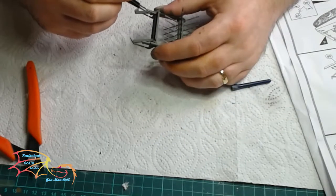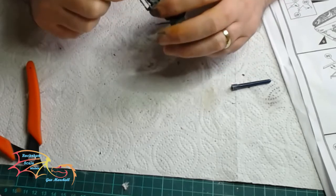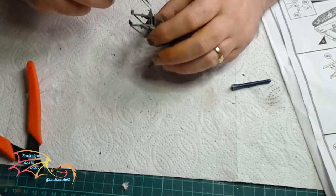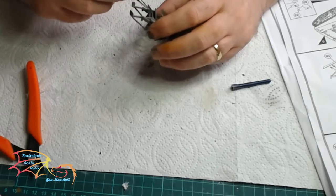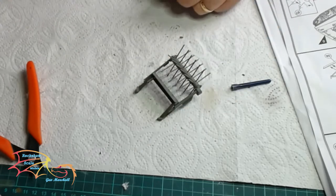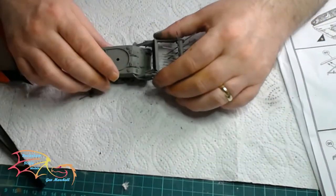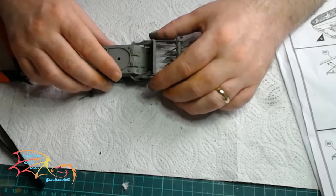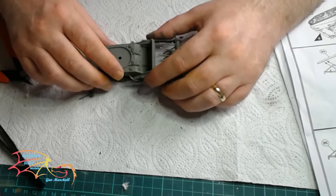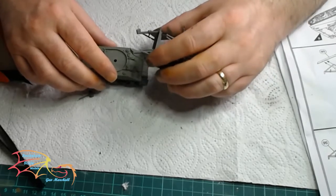Lastly there are two supporting plates — triangular pieces that go on. Make sure you get them at the right angle. Also the little pin that you see dropping down — make sure that's positioned to go on the outside of the tank, not the inside, or you'll find the cradle won't fit properly. As you can see, that's on the inside, so the cradle will not fit properly. That was my fault — I actually got them the wrong way around, but I was only test fitting at this stage anyway.